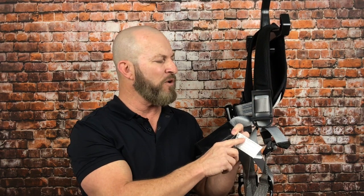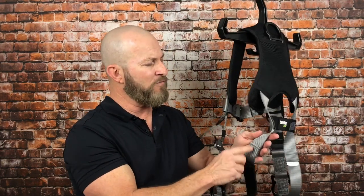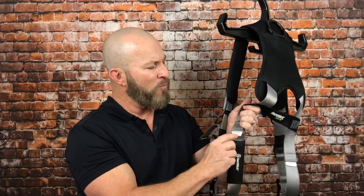The second thing we want to note is that behind the part number there's an S/M. What they're telling you is that this is a small/medium harness. Conversely, they make another one as L/XL, or you can get a double extra large or an extra small. Now, when you're sending it back out in the field, make sure you close this, because if the tag gets messed up, or you can't read it, or it's missing, I have to fail the harness, and that's per the manufacturer's guidelines.